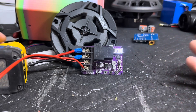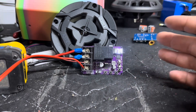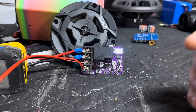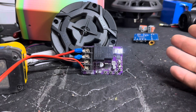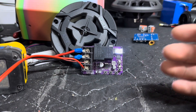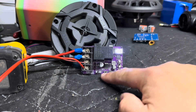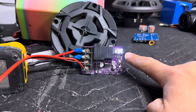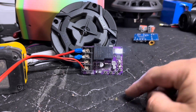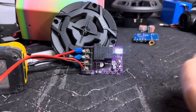For DeWalt batteries, you would set the voltage based on what you measure. You're going to see the voltage at full charge at 20 to 21 volts — test that with a multimeter. At full discharge, 15.3 is what you want, and a safer limit would be 15.5. In automatic mode, after 60 seconds the display will shut off. In manual mode it'll shut off and you'll have to hit the reset button when you put a new battery in.